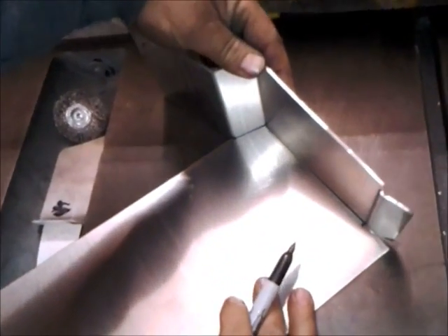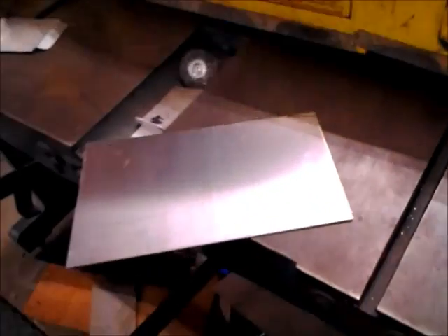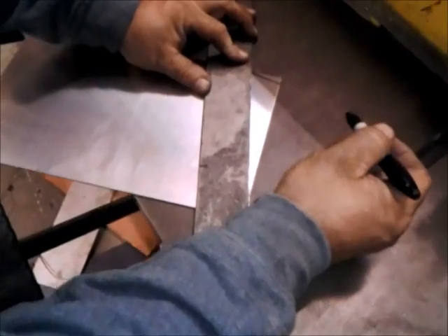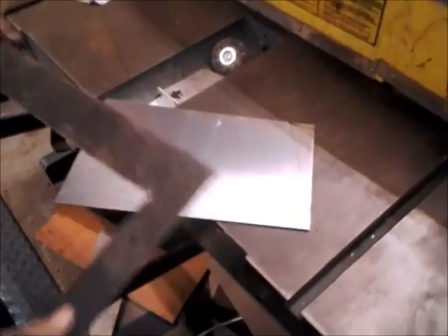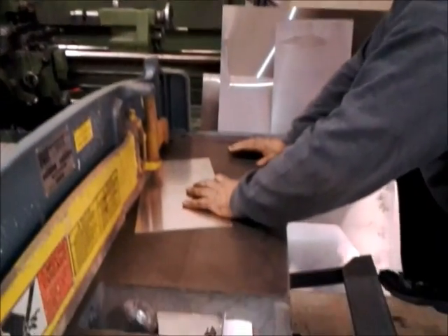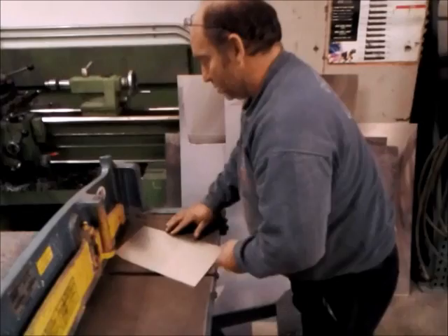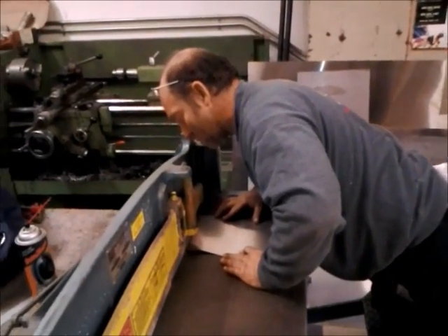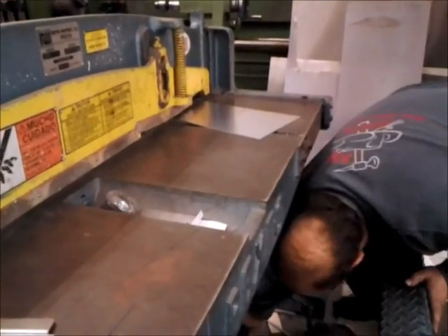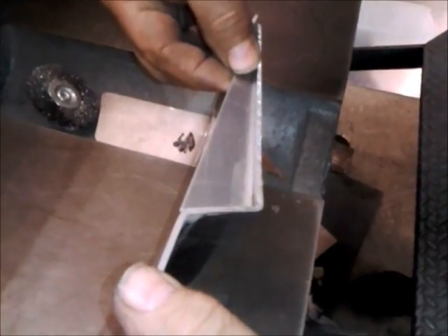I've got to make the side pieces out of our excess. We're going to put that there, put a little mark so we know where we're going to go. We're going to take a straight edge, go from point A to point B, then I'm going to shear it and hopefully we have a side. I'm going to make my first cut, which is the front — actually the rear side right here. Then I'm going to cut the bottom, which will be our bottom piece. And basically what I was attempting to do is — voilà — one side piece.